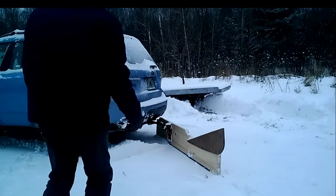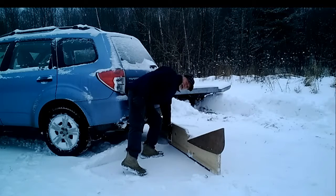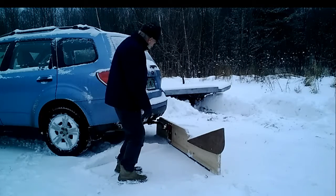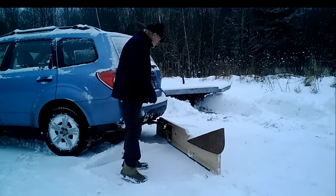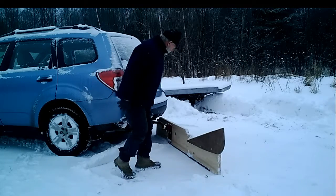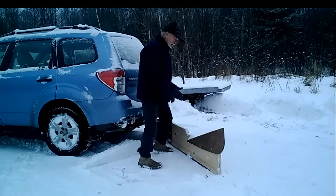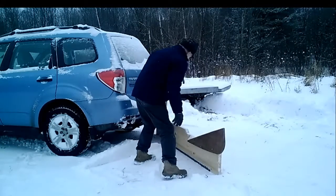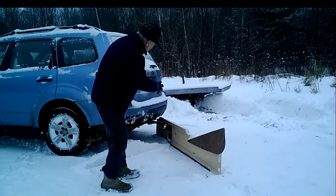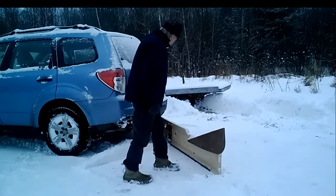I'll show you some of the details of it. The key to it is this steel weldment here, which is a piece that I couldn't do myself. Some people with good welding skills and metalworking tools could make it easily from a simple plan. Basically, when you're pulling forward, the blade of the plow is unbalanced — the bigger part is on this side, the smaller part on that side — and that makes it tilt and it stops based on the steel in that little cradle that attaches to the drawbar. That determines the angle. I'm using about a 45-degree angle.